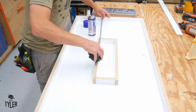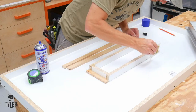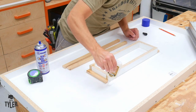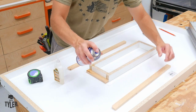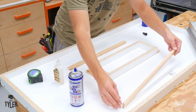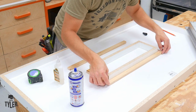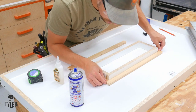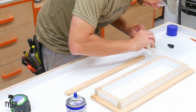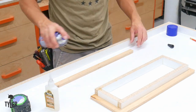The forms are also made out of the same melamine material and I'm using some fast-acting CA glue to glue them down in place. This little edge right here is going to make the shelf for the fire tray to sit on. I've sanded a little bit of a radius around the edge so it conforms to the fire tray very nicely. I'm adding a little more CA glue in the cracks to make sure the concrete material doesn't sink down inside.